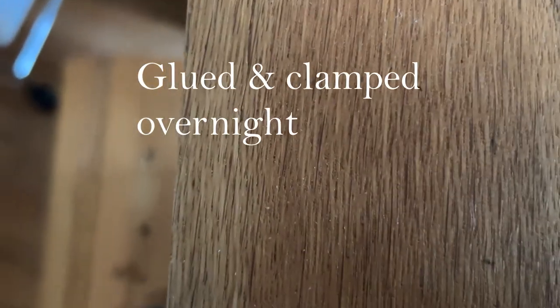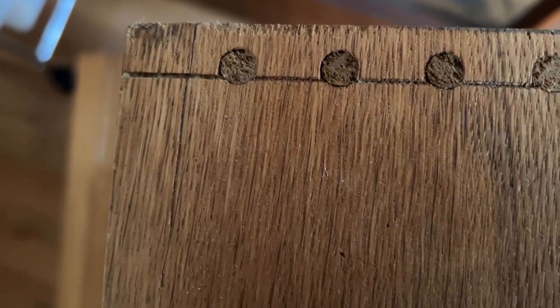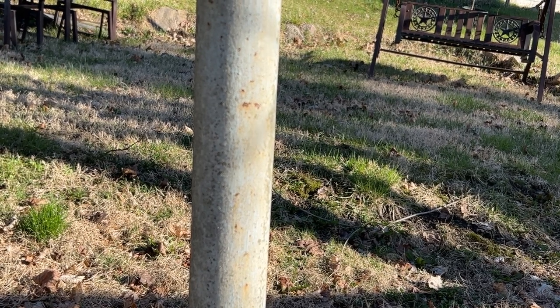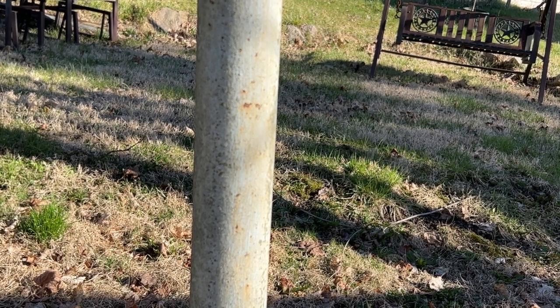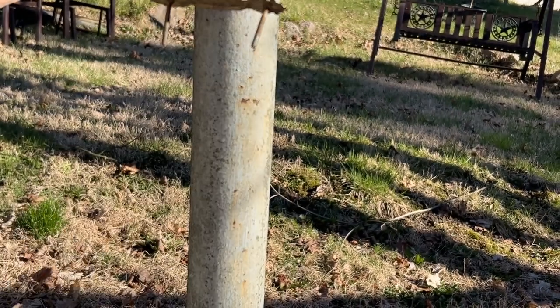One thing to remember, when you're working on oak, which is often wide-grained, you should use additional shellac until you've filled in the grain of the oak. When you remove a painted finish from an oak piece, you'll often see bits of paint still stuck in the grain after you sand. If a person uses several coats of shellac under their paint, this is less likely to happen. The next person who refinishes the piece can simply scrape off your paint without altering the wood surface at all. I'm comfortable refinishing this way.